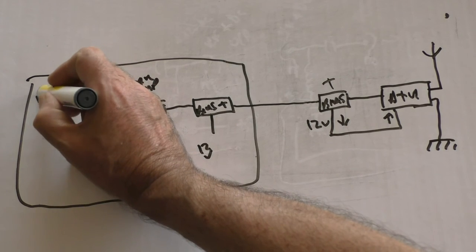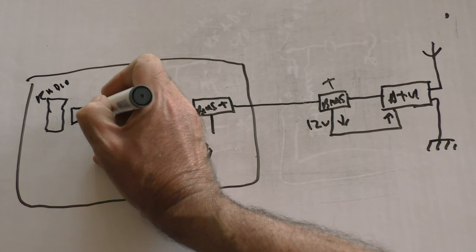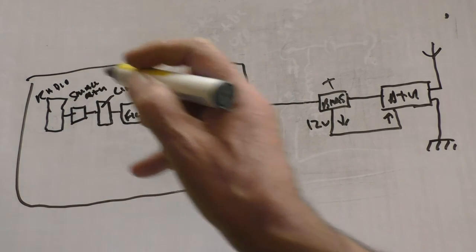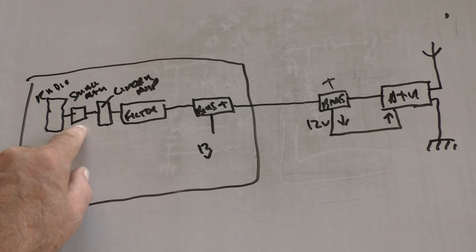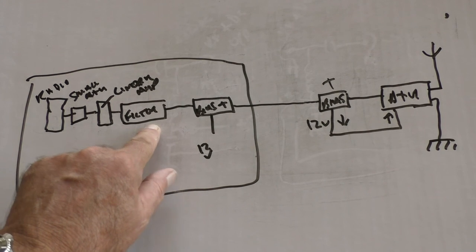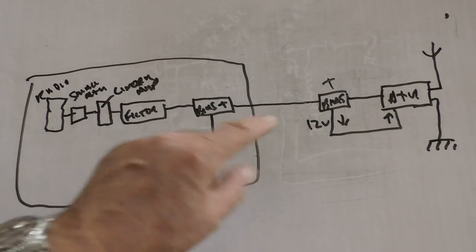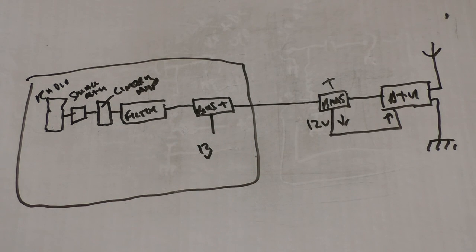So that's the radio. Then we've got the small ATU. Radio, small ATU to match the input impedance of the linear amp. On the output of the linear amp, the filter. So basically the filter is the last thing in the coaxial line, apart from the ATU and the bias T's if you're putting DC up the coax. So that's the order the equipment is connected together.